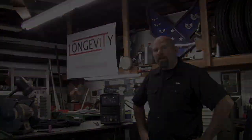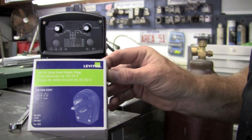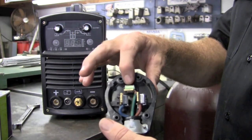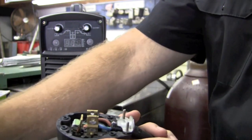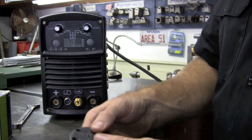Now let me take you through the setup. Made a trip to Home Depot and bought the Leviton 30 to 50 amp plug — it's compatible with my shop. Take the green for ground, and the blue and red are your hots. Install the cover and get that torqued down evenly.